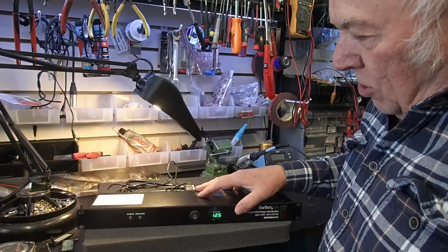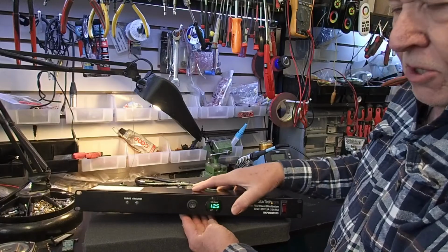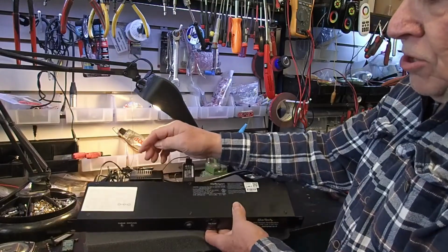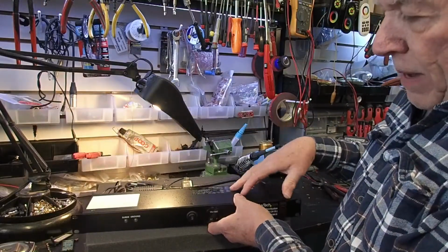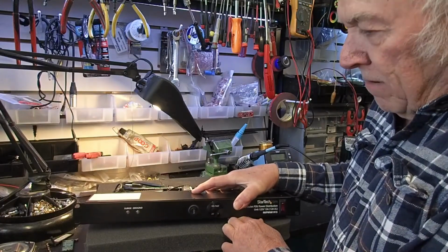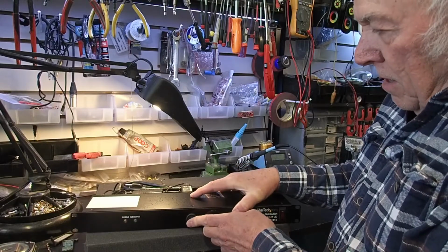Now, to show the switches, the center position is 0. And that's just for AC, running the transformers. Top is for the battery to kick in and combine with the transformer. In the bottom position, it activates our charger, and the charger then would go into the single port in the back and charge the batteries. Now, a lithium battery, just like even lead acid at 10 volts, is considered technically almost a dead battery, so at that point you need to be charging. And of course you can monitor the voltage of your internal battery through the meter here.